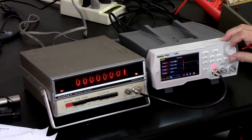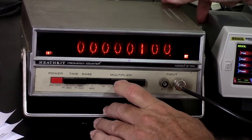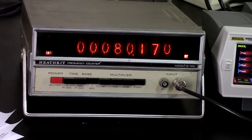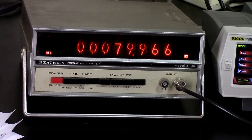This seems to be millihertz? Wait — there's a 100 hertz reading. On times 10 that's not right. Times 10 — still not right. Times 1000 — not right either. So at low frequencies, it looks like the multiplier isn't working right. It seemed okay at higher frequencies at 100 kilohertz. I've got some burned-out bulbs and two decimal points that aren't lighting, and then it needs a tweak on the oscillator.